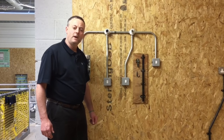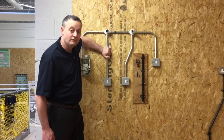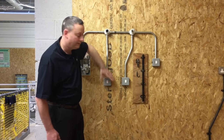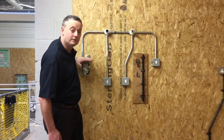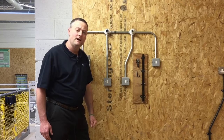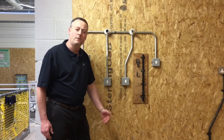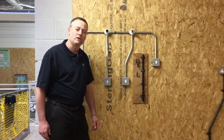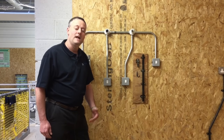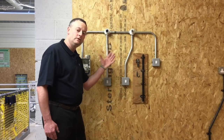We also talked about exposed conductive parts — they are electrical and metal and need connecting to earth. The steel conduit is an exposed conductive part, as is the metal-clad light switch and the consumer unit. The exam expects us to differentiate between an exposed conductive part and an extraneous conductive part. Extraneous conductive parts include things such as a metal water pipe, a metallic gas pipe, or the metal structure of a building. If it's electrical and metal, it's an exposed conductive part.